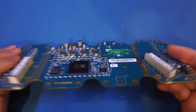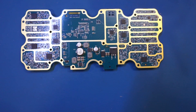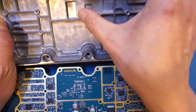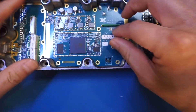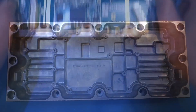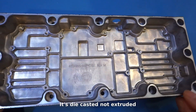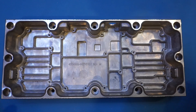Now let's flip it over. You can immediately see how crowded the reverse side is. The side of the PCB is segregated into many different sections, as you can see from these gold-plated ground traces. There are also matching RF gaskets on the aluminum cover — you can see these protruding soft materials, which are the gasket material. When closed, these form a very tight Faraday cage and provide shielding and prevent interference amongst different sections. It appears the case is made of extruded aluminum, and if you look carefully, you can see a weather seal along the edge, because this unit can be mounted outside and is supposed to be waterproof.